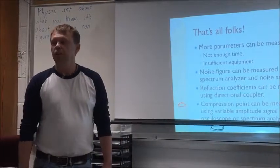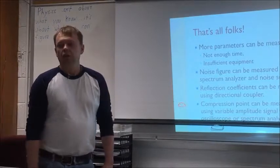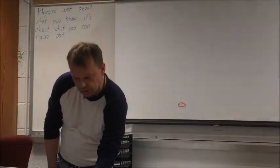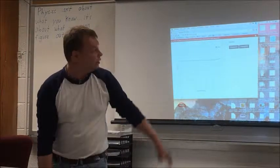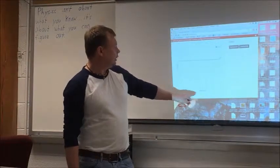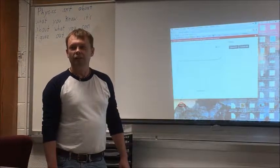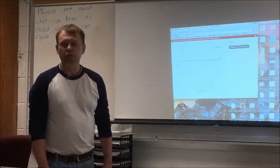Now that signal you were putting through it, that's doing a frequency scan from what frequency to what? 60 megahertz. So that's 0 at the bottom, all the way to the top, 60. This is 0 here, 60 is here. It's pretty flat all the way across in frequency. Well, from a device which is spec'd up to 6 gigahertz, I would expect it to be flat.